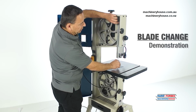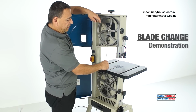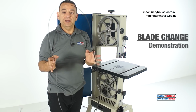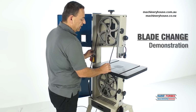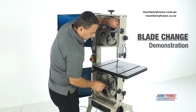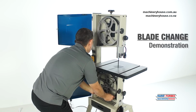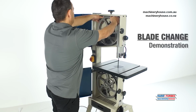Now, sometimes it can be a little bit tricky to get it out of the guides, but there you have it being removed. Now, I'll just replace it and put it back in. So it's lining it up, just carefully looking where the blade goes, getting it inside the guides, and checking down the bottom as well, all the way around. Make sure the blade hasn't flipped off.